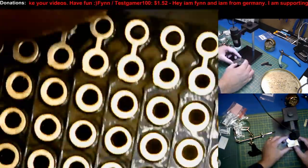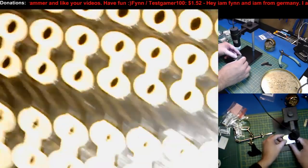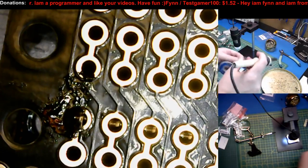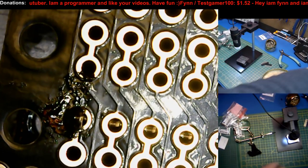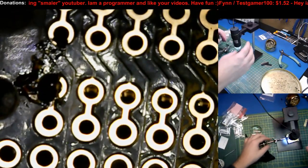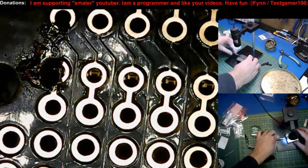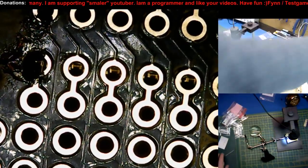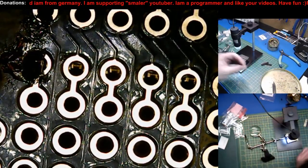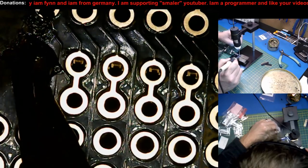I hope the feedback on these is of interest to you guys. I know it's tough when you're starting out to know what you're looking for in a good joint versus a bad joint — it's just something you kind of get a feel for as time goes on. But unless someone really shows you what good and bad looks like, it's quite tough. This overhead view doesn't lend itself to understanding whether the joint is good or not — you can't tell from a straight up-and-down view until I show it from a little bit of a side view. But you can at least see the technique of how I'm bringing in the iron, giving it some solder.